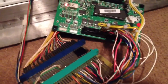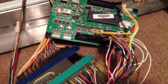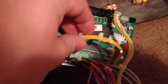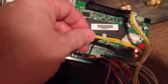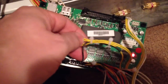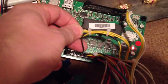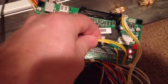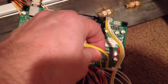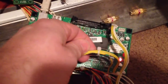Basically, I wanted to try Shikigami no Shiro, and I needed to spoof the second coin meter. If you look online, there's information about it. What I've done is I've taken the digital output, which if you look for the pinout online, you can find it. Andy Geezer at AGS has it on his website. If you go through pin 50 with a wire and then put a 100 ohm resistor to a 5 volt line, it will spoof the coin meter. It'll think there's a coin counter in there, even though there isn't.